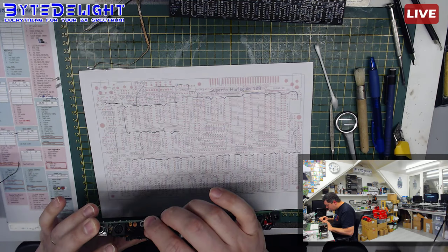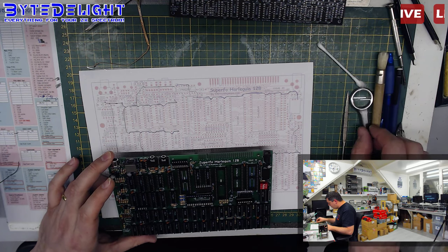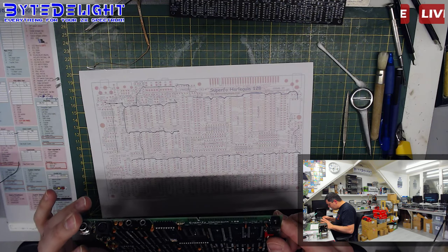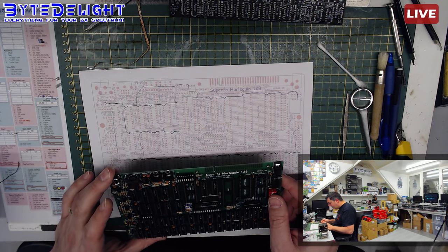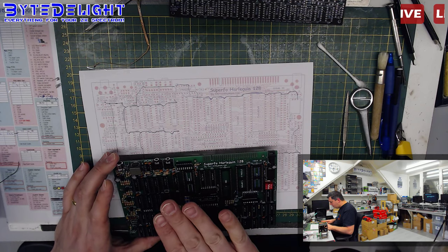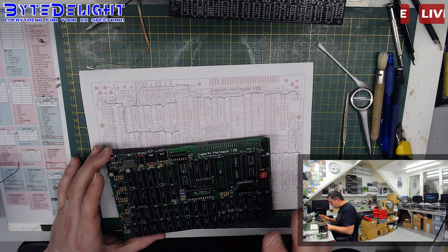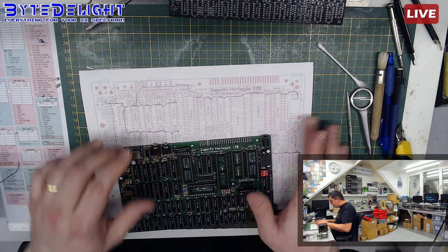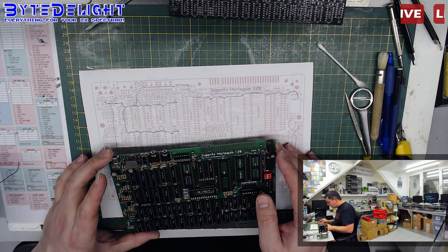Could be a capacitor. I have a couple of capacitors here. Maybe one of them is defective. That sometimes happens. It should not, because I don't want people to get defective parts when they want to assemble such a kit. But of course, I cannot rule out everything. And we do actually test all 100 nanofarad capacitors, which are a lot, because there are 24 100 nanofarad capacitors in these boards. And we do test all of them, because we buy them from China, and it's better to test them instead of buying local ones, because they're so much more expensive.